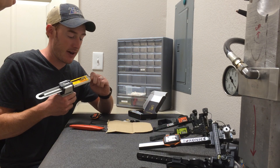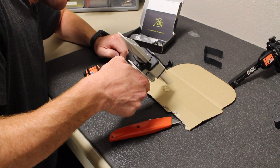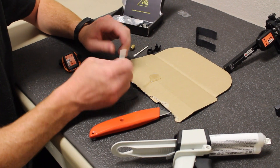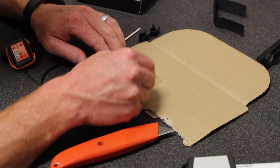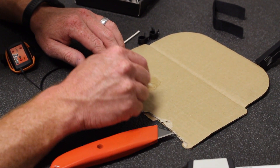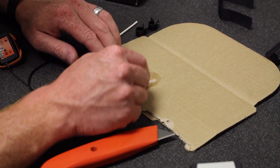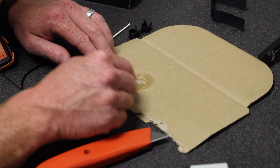What I do is I get my epoxy, open it up, and pour out the parts I need to mix. Of course with any epoxy you're going to have to stir it up and make sure it's mixed properly. With this particular epoxy — and most epoxies — you can kind of see the chemical reaction. You're going to want to wait until it's really clear or milky, depending on what epoxy you're using. That's how you know it's starting to set up and take effect.